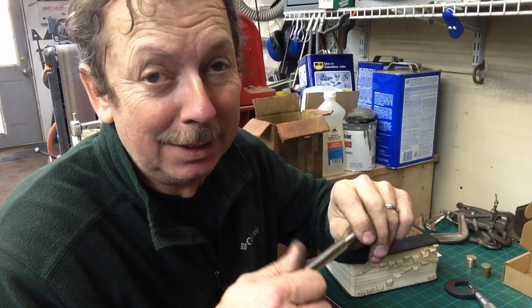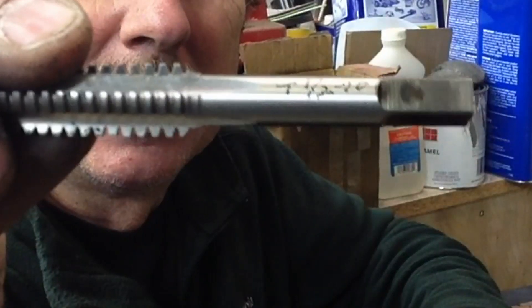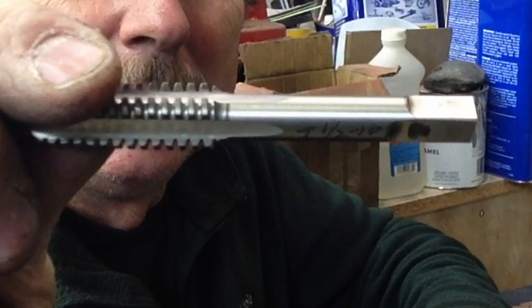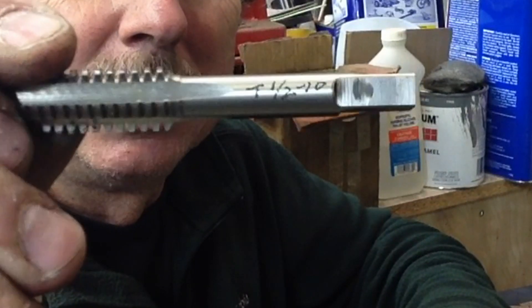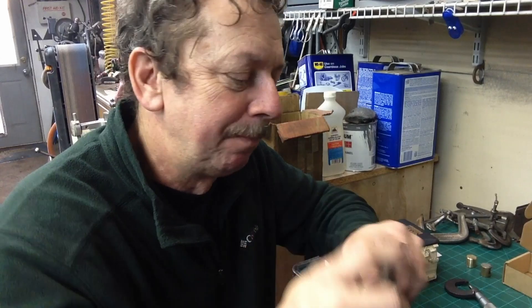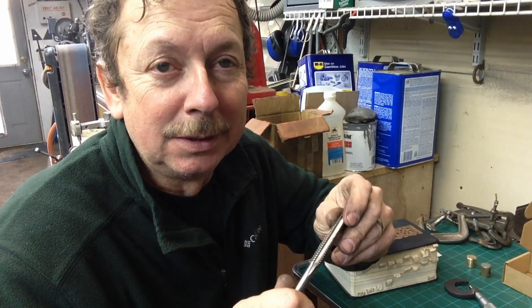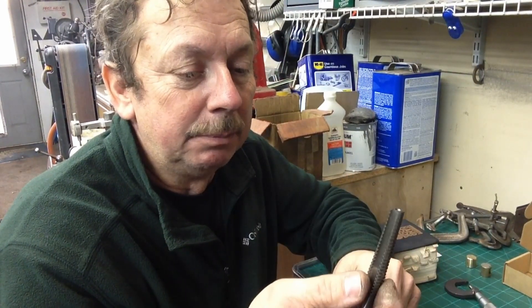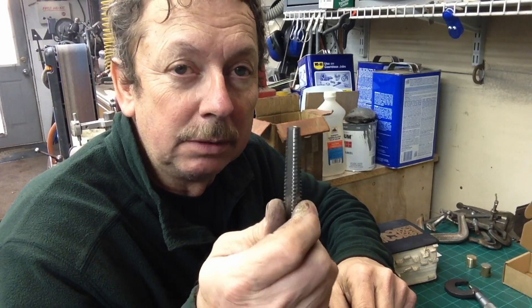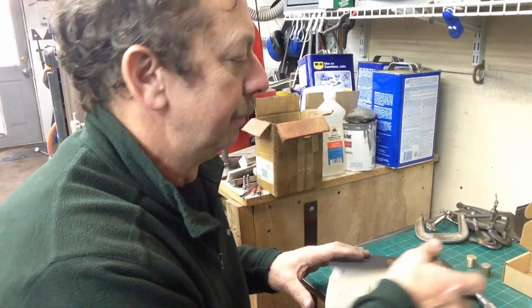I was a little disappointed that it didn't say made in China — it has a little engraving that says T 1/2 by 10 and that's the extent of it. You can look at the square on the shank and it was ground the same distance on three sides, and they kind of ran out of grinding wheel on the fourth. Anyway, I started measuring this and the outside dimensions — as near as I can run a mic down from top of the cutting surfaces on opposing sides — is 0.5215.